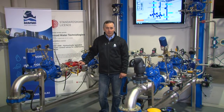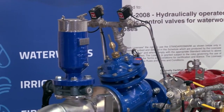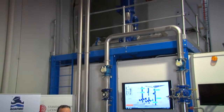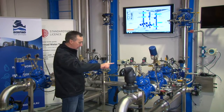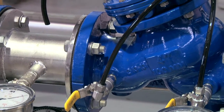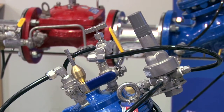We're here now at the training facility where we do a lot of the hands-on training for the specific components and products we put together. We have a tank with a couple of pumps that can produce up to about 140 metres of head and flows up to a maximum of about 20 litres per second. We pass these two flows down through two parallel trains and return the water back into the tank. The key aspect of the design is that operators, users, or visitors can come up very close to the products and actually see them operating very easily.